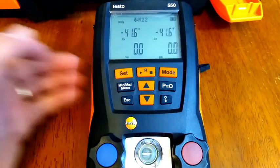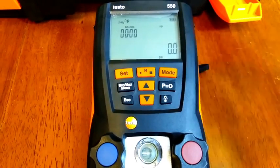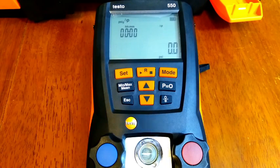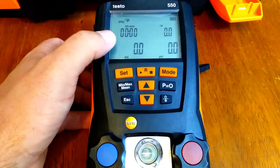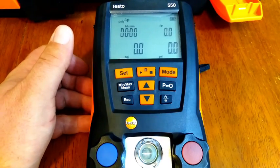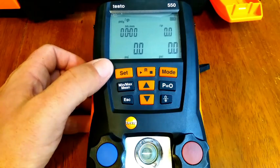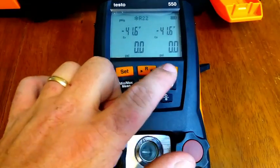We also have the escape button, which takes you out of wherever you are. Hitting the mode button, we have our basic mode for getting superheat, subcooling, and refrigeration pressures. Hit it again and now we're in our nitrogen test mode — this is my favorite thing about these gauges. You put your pipe clamps on your refrigerant piping, charge the system up with nitrogen to test for leaks, and it will compensate for temperature changes on the pipe during your leak test. You hit the start button, it counts off the minutes and shows how your pressure changed over time, so you can come back 30 minutes later and check for a pressure drop. The Testo compensates for temperature fluctuations so you're not tricked into thinking you're losing pressure.